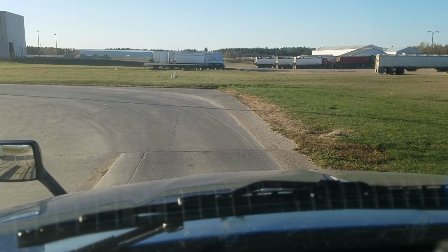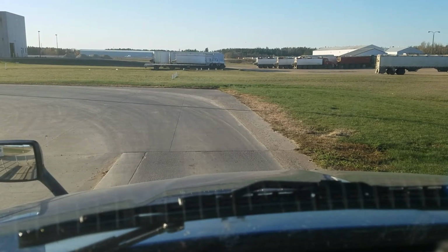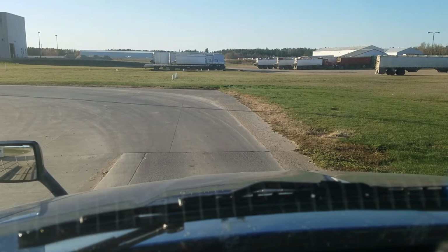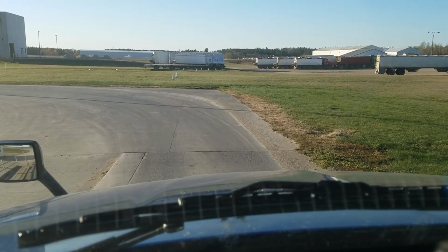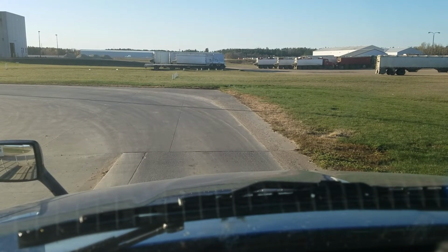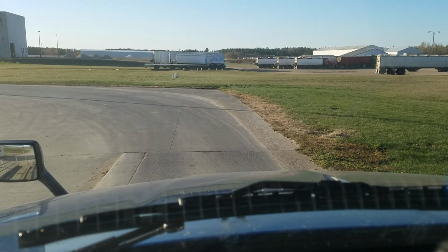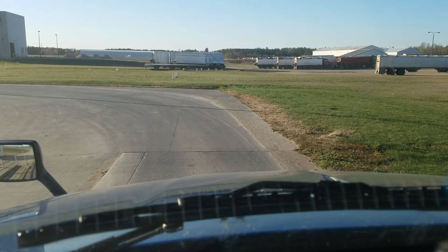How much fuel do you have on board? Look at your... Oh, we're just under 3/4. Just under 3/4. We want to know that to see how much fuel that we can add. Okay, now we take the total, the 45,580, and subtract it from the gross weight, the 78,260.